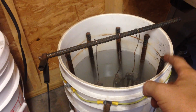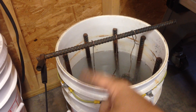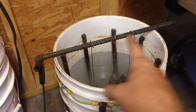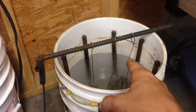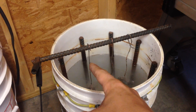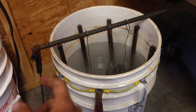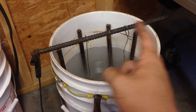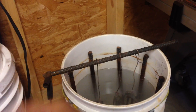What I've done here is all this rebar — that rebar, that one, this one, this one — all of those are linked together. And then you've got this rebar that's laying across the top; it's not touching any of those. This is what we're hanging the part to be cleaned. The part to be cleaned becomes the cathode. When you apply power — anode, cathode — positive goes to the grid, negative goes to the bar that you're hanging the part to be cleaned. Then you plug her up and let her go.